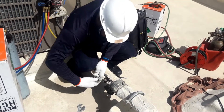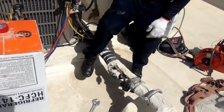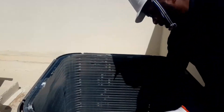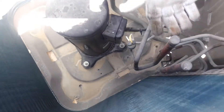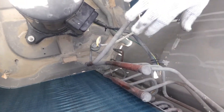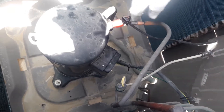This one is done. Secondly, what I will do — I disconnected already, you can see, only the discharge line. This is the discharge line from the compressor. This AC outdoor unit doesn't have any capillary tube — you can see there's no capillary tube here — so we can flush directly without any problem. I disconnect this discharge line.